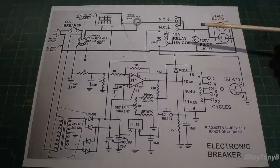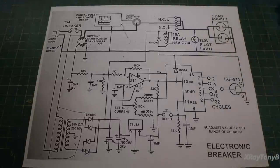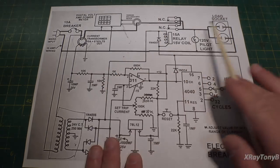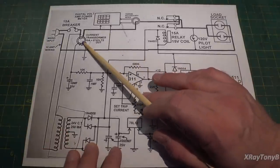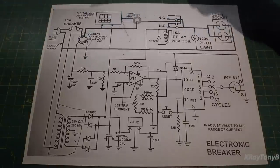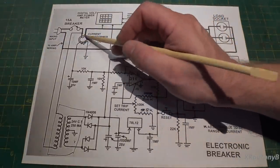Here's the original circuit as Ron designed it and shared with us. He has a current transformer — here's your power coming in, here's your outlet going out. With the exception of these relay contacts, it's basically a straight-through circuit with just a set of contacts breaking the circuit. This little transformer you can buy — I'll share a few different ones that I have. I did something a little bit different, but essentially all this is is a little toroid.